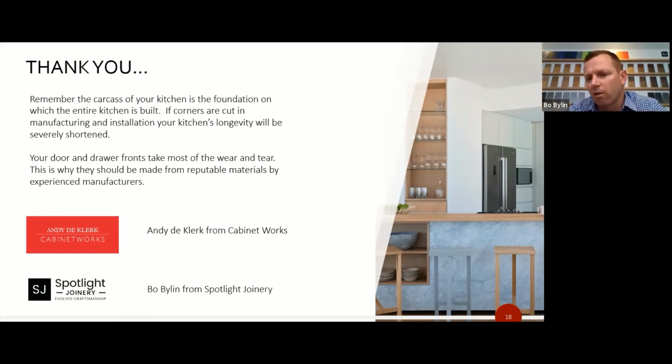So if you had to look at the back of the door, there is sometimes a rebate in the door to allow for that center panel to expand and contract. The biggest challenge that you're going to get is when you are applying your finishes to your solids and your veneers, whether you're staining it. Often your solids suck up that stain a lot more than your veneers do, and you tend to end up with a big color difference. The veneers as well as the solids will also age differently.